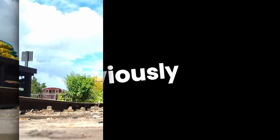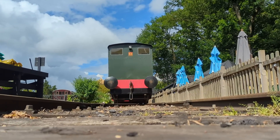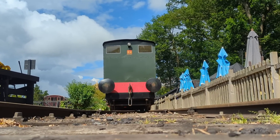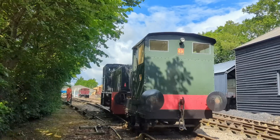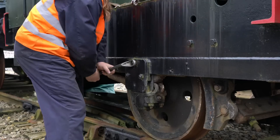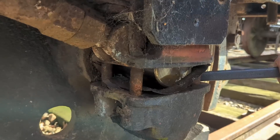Over the series so far you've seen some of the work required to get 294-266 ready for this moment. The first stage was to move it into the shed at the Mid-Suffolk Light Railway, where Neil and Nigel could remove the drive chains. After they'd been removed, the loco was dragged back outside so we could make a start on removing the axle box keeps.